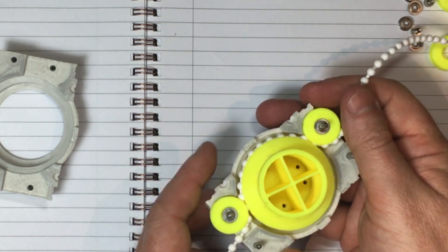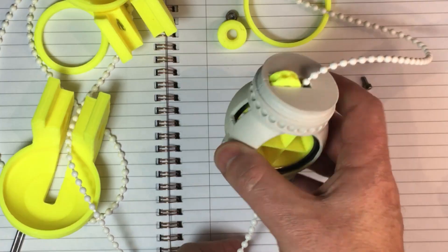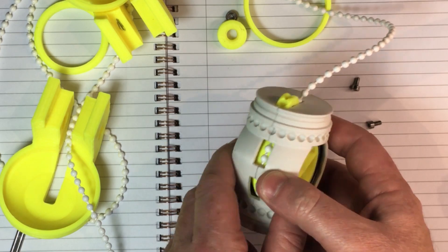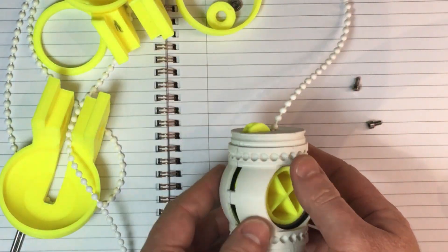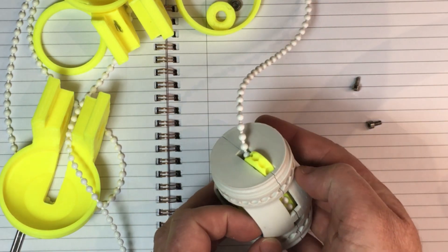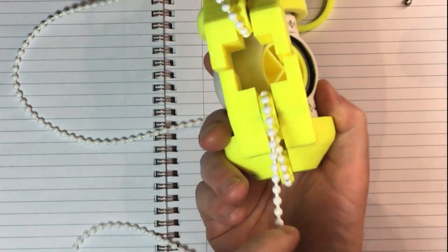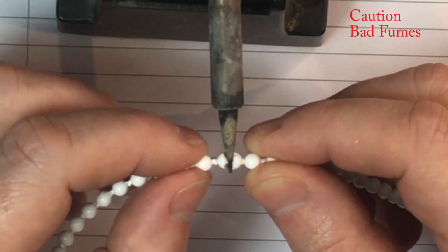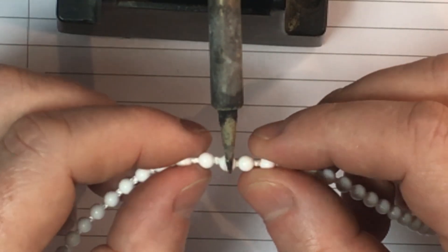Keeping the cord tight is important, and I think they are less prone to skipping than timing belts, especially if you create a fuller cut. The beaded cord can be made into an endless loop, which enables the final joint to have continuous rotation.